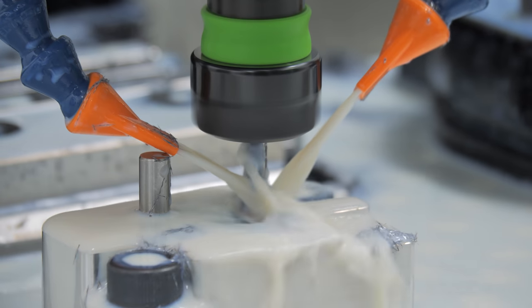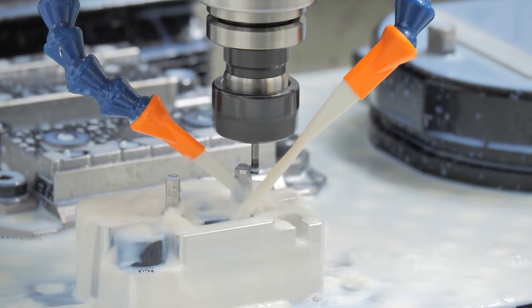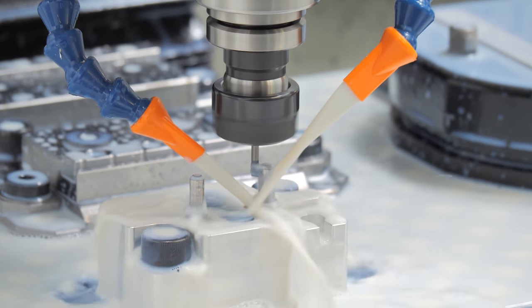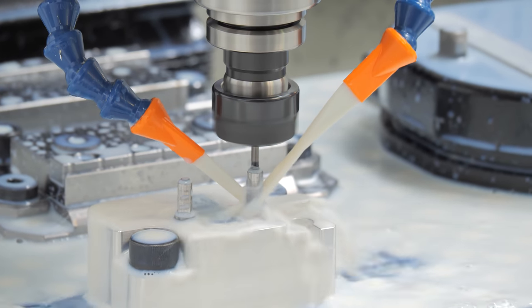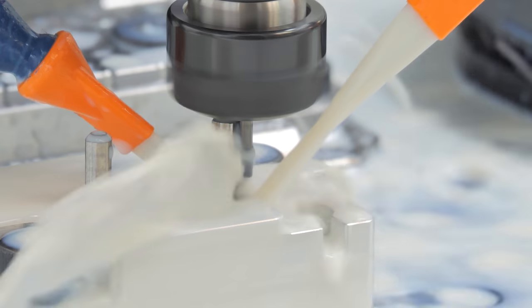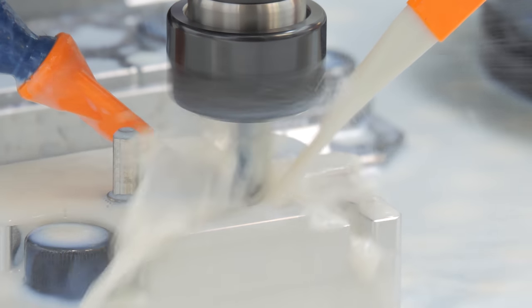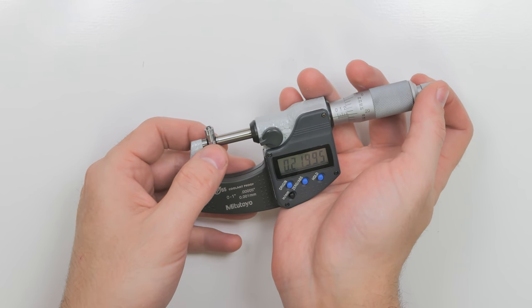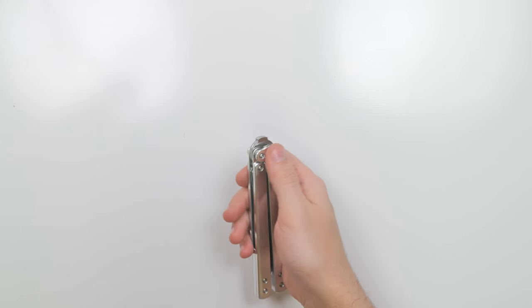I thought the taper was from end mill deflection. I switched to a necked end mill with shorter flutes. More carbide means more rigidity, and by taking smaller cuts, I also reduced the cutting forces. I still ended up having to take a spring pass, but I was able to remove the taper. This was a huge improvement to the button.